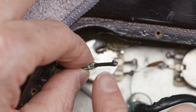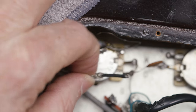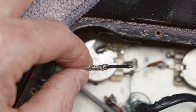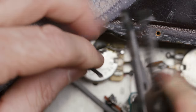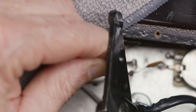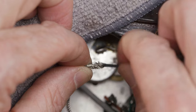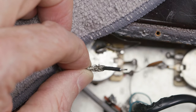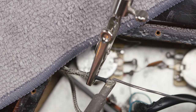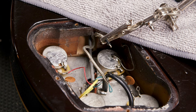As long as we've got a nice clean end here, that's what we're going for. We don't want any of this touching that end here. Now I'm going to take a little bit off the end here, twist this wire a little bit, and just going to tin that in there with just a little bit of solder.